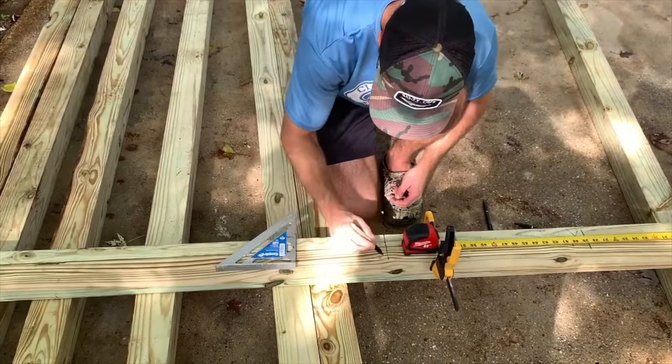What's going on, everybody? So in the last few videos in this Modern Shed Build series, we framed the shed walls and then we installed the T111 siding around the perimeter. And now in this video, I'm gonna show you how I attach the sheathing, which is just 1/2-inch plywood, to the front of the shed and the sides. We're also gonna install soffit sheathing, which is kind of a pain. After we get that sheathing in place, we can install the veneer, but we're getting ahead of ourselves. Let's start with the sheathing.